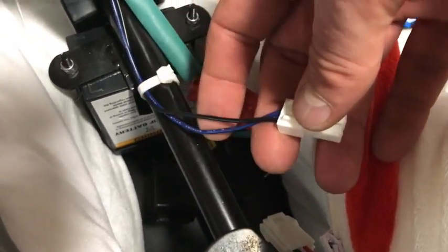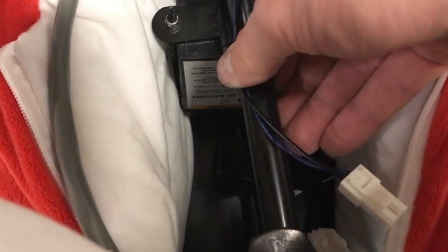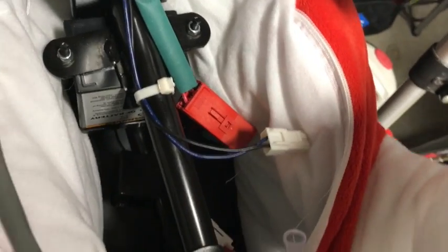Okay guys, what I'm going to end up doing here is, I got some short wire coming here from the electric motor leads. You see how short that is? So what I'm going to do is zip tie the connector on this side down to here. I'm going to get that puppy nice and secured. And then on this side, see, I'm working with that much space, and I need to tie all four of these wires in there. So I cut the tail off that zip tie, backed that puppy up as much as I could, and tried to get as much lead out of this as I can. But I think what I'm going to end up doing is cutting this in half here and using these four wires to tie in to those four. That way I'm not shortening this lead anymore, because I don't want any of this wiring to be more exposed. As you can see, this zips up in the belly here. So let's give that a try and see what it ends up looking like.